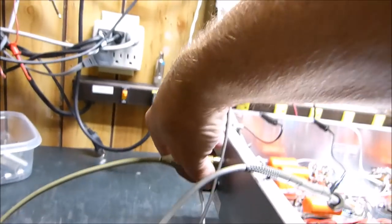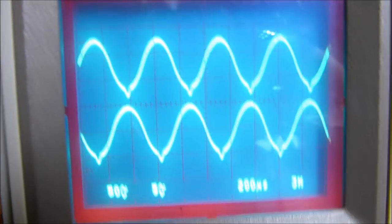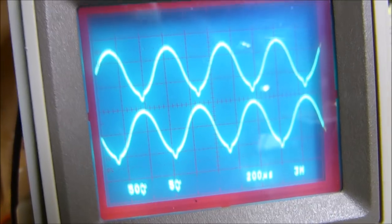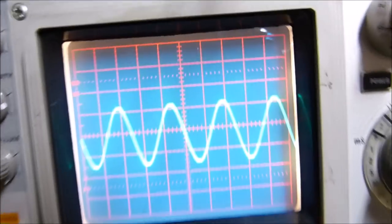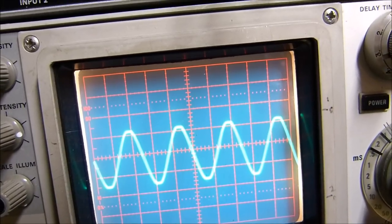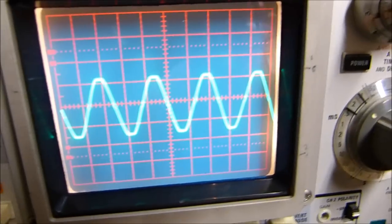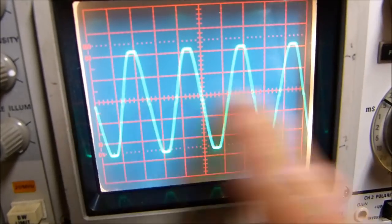Okay, now I'm going to start raising the gain right here a little bit, and watch what happens. You see those little dimples that come in there? Well, at least it's symmetrical, isn't it? But that gets cleaned up pretty darn good right there. There's its output again. If we keep driving it, we're saturating the tube. See, we're squaring off. Let's increase the gain a little bit. Actually, this amplifier is performing really nice. We start seeing some crossover distortion in there too.